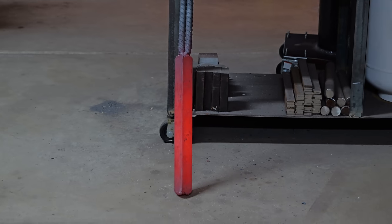I think I may have outdone myself with this one. After file testing the blade for hardness, I chuck it into a small toaster oven at around 350 degrees for a quick flash temper. The reason I need a quick flash temper is because the kiln takes around two hours to cool down, and those two hours where the knife is just sitting outside could be the difference between developing a crack and not. Directly after heat treat we're at two pounds.